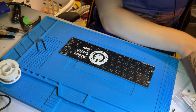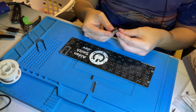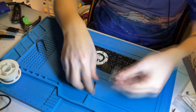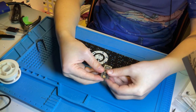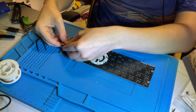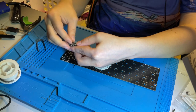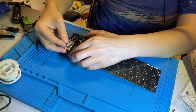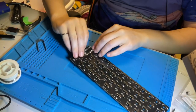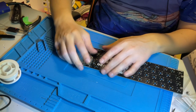For the microcontroller, I've got an Elite C and the pins that come with it. The short pins go through the Elite C, maple leaf facing up. Put the pins through like so, then place it in the spot and make sure everything is positioned correctly — normally it would sit much more flush. Once it's in, flip it over, keep some pressure down on the table, solder all of those pins, then flip it over and solder the top so everything is completely connected.